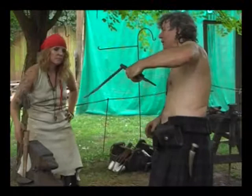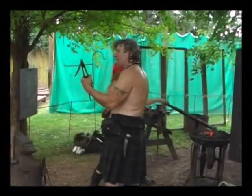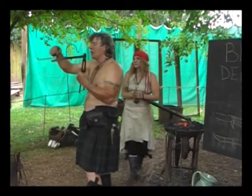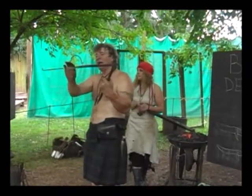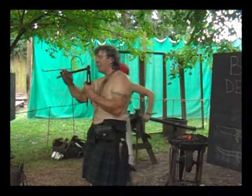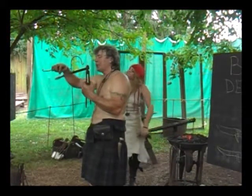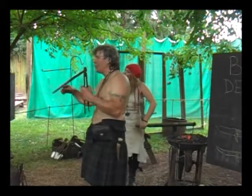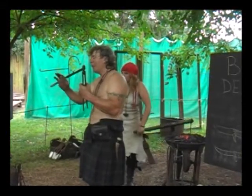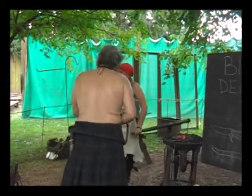He's taking more of a shape. He's got a face and some gills and a little bit of fins sticking up and down. And now his body's starting to take shape. The next thing we're going to do is heat it up and put some scales in the body. We're going to take a punch, lean it at an angle, and just make a whole bunch of scaly kind of look, and then flare out the tail. And we'll have a couple nice looking fishes.